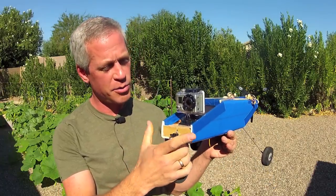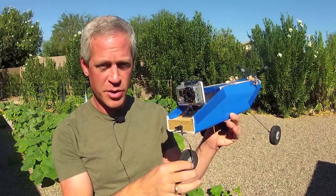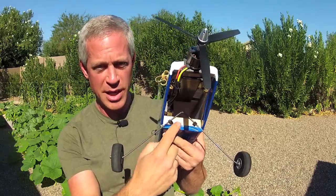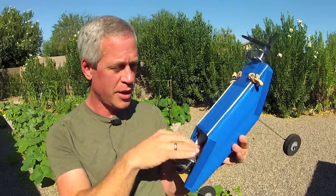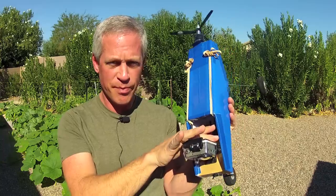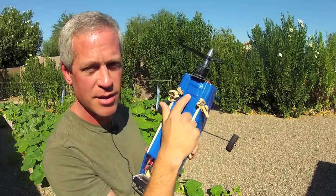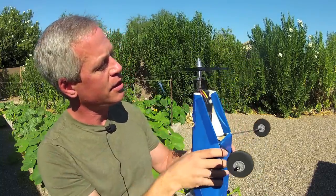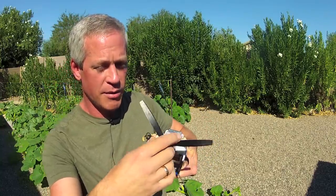Here is the larger fuselage pod — a 3-inch nominal fuselage tube, about 3.5 inches total diameter. I've used a piece of balsa block to act as the GoPro mount and nose gear mount. The nose gear is not steerable but it wouldn't be hard to accomplish. The main gear is zip-tied to a piece of balsa that forms the platform, and the batteries fit in between the balsa pieces on a tray. The receiver is in the front. The wing is rubber-banded down to carbon fiber aero shafts located inside, with rubber bands passing through a hole to access the tie-down. This is a Turnigy prop drive as well, 1800 kV with an 8x6 prop for additional ground clearance.